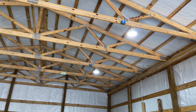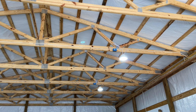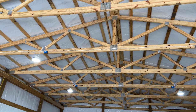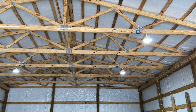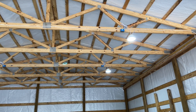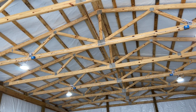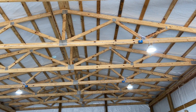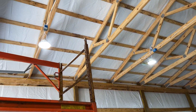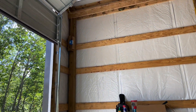I learned a lesson and wasted some wire I didn't want to waste. The runs connecting the wires up there are actually 14-3 wire because that's how I ran it originally. I thought it wasn't smart to strip all that down and run it with 14-2, so rather than the extra effort, I just capped all the red wires in those junction boxes. There's no current connected or anything going on those wires, so that's okay.